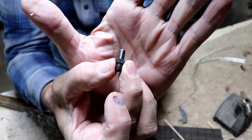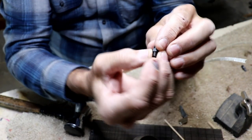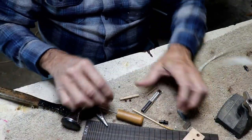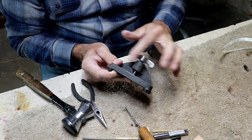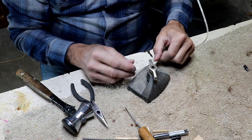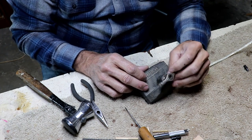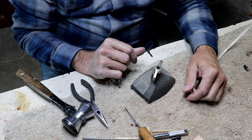I split the side of the punch out. I've got several in there but they aren't coming out. I did make several already; I'm just not completely happy with them. This old school punch — you twist it down and it punches. But the problem is this stuff is so narrow it's pushing it down in the hole. If I had a brass plate or a piece of aluminum to push against, maybe it would cut them off clean. I'll try aluminum first.